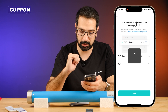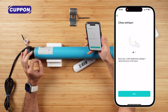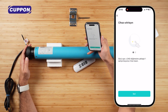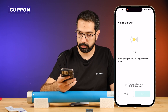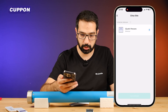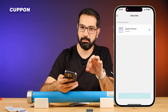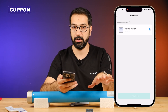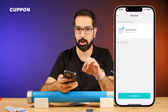This Wi-Fi information must be 2.4 GHz — you need to connect to a 2.4 GHz network. It cannot connect to 5 GHz networks. After entering the Wi-Fi information, I say next. Now the device needs to go into pairing mode. I press this button three times to get it into pairing mode. Our light started blinking. Now I say next. I confirm that the light is blinking, I say next again, and it quickly found it as a guillotine window. The device, the phone, and the modem or router to be connected must be close enough to each other. The closer they are, the faster this process will be finished.